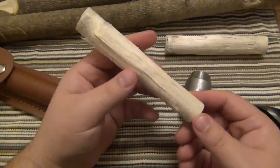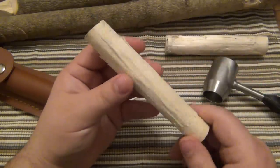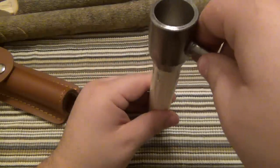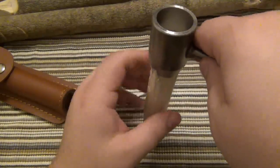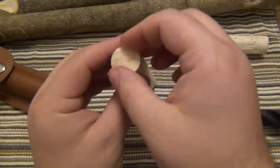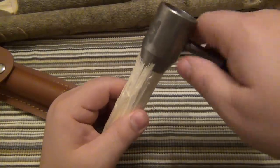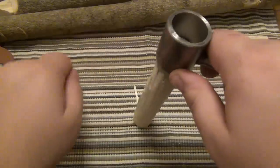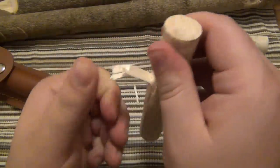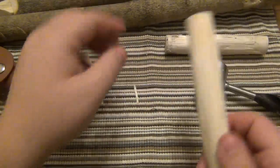You can do different bushcraft projects with it. On a quick side note with the pegs — I wanted to keep the bark on just so it looked nice, no other purpose than looking more finished. What I found was once I made the cut on top, it made the perfect peg but all around it the bark basically splits off. So because it was so cold out I just grabbed each piece of bark and pulled it off, peeling it like a banana. The center part doesn't really matter — I just needed both ends to be the exact size for the holes.